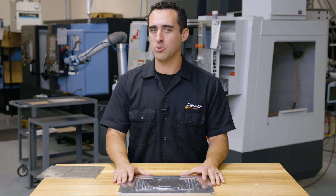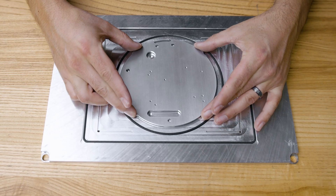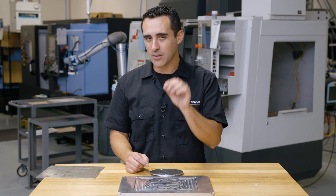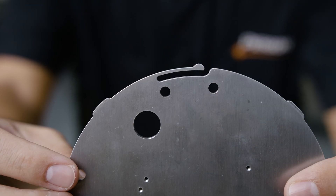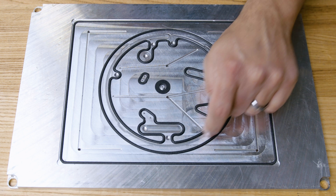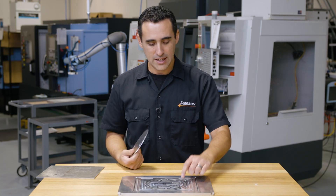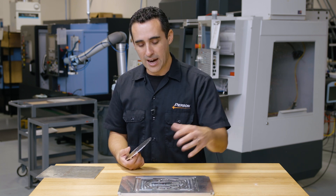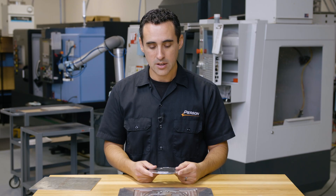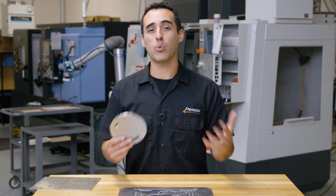You can't do this on a standard vacuum chuck — you have to use the top plate. Watch as I remove this and take a look at all the areas that break through and see how they're isolated from the rest. You see how I grouped together some of the holes that break through? There's no need to gasket individual holes — sections of holes are best. This part also has an odd little flange; there's no way to get vacuum applied to that surface, so we simply place that feature on the outside of the gasket. The area between the remnant piece and the finished piece has all the features exposed to the atmosphere. Air is held inside the two gasket regions, but not in the pockets or areas where the end mill cuts the perimeter. It looks complex, but in reality it's quite simple: two separate gasket areas, avoiding areas that break through so we don't lose vacuum pressure.